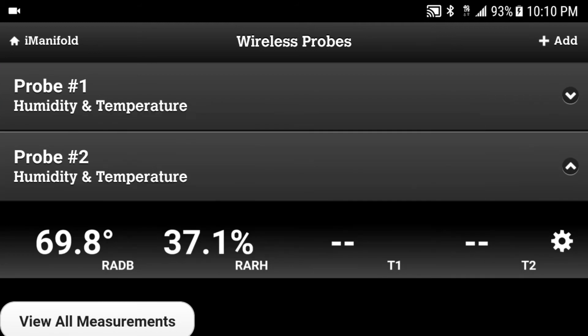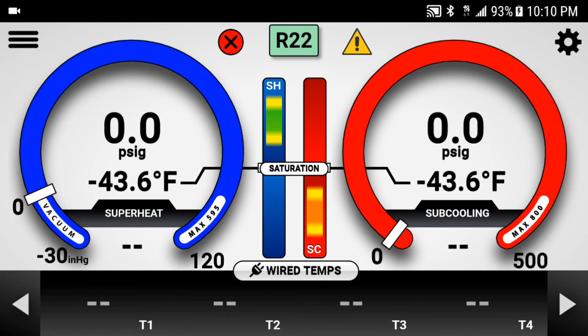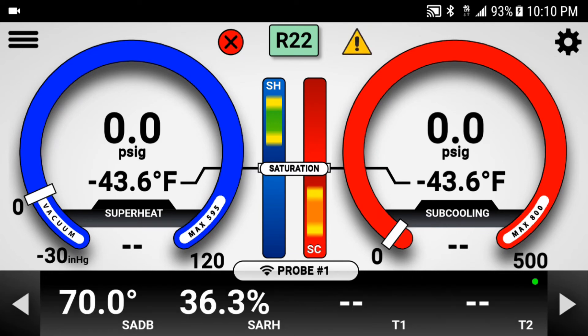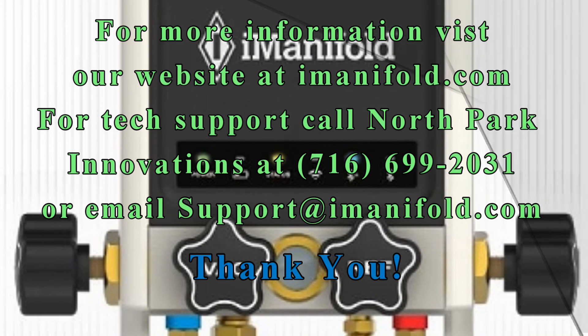You can map them however you'd like. We're going to go back to the home screen and we'll see the measurements being put up by probe 1 and probe 2. Using the arrows at the bottom, we'll find probe 1 — it's displaying supply air dry bulb and supply air relative humidity. We'll scroll over to probe 2 and see that it's doing return air dry bulb and return air relative humidity. Both probes are connected and sending information, so we're ready to go. We'll see you next time.